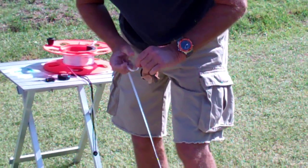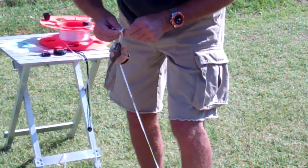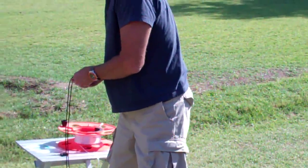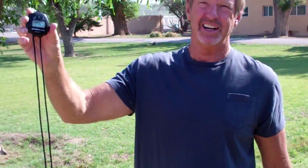It's two minutes and 19 seconds to do the deployment, and that's with me talking and fumbling around with tying it on. So let's say it took about three minutes. We're running at $60 an hour, so that's a dollar a minute — you've got about $3 in terms of the actual time involved in the install of the hydrosleeve. Then what you would do is come back when you're ready to do your sampling, usually months later, and recover the hydrosleeve and collect the sample. So we're looking at under three minutes to do an install.